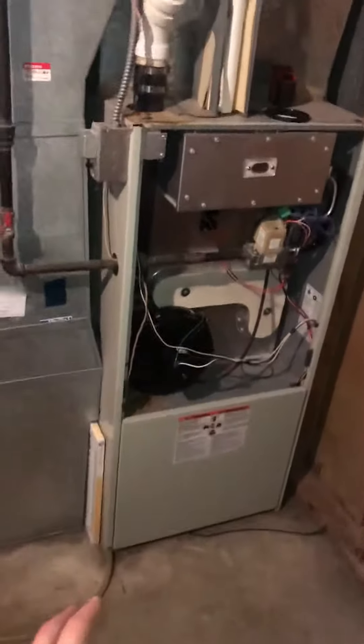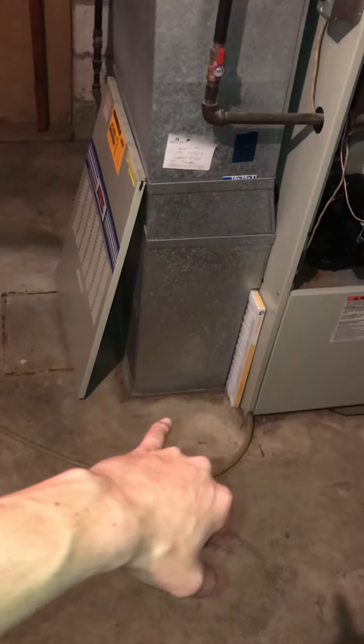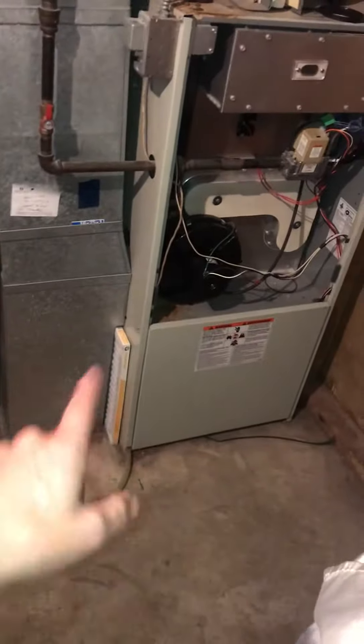I'm thinking we're going to get you guys a base can so it works pretty well. You've got the entire plenum to work up to — that's got plenty of space. We may even shorten the plenum to make it work. I'll make sure you guys have everything you need: the gas line, the electric, everything right there. The filter's too big — it's a 16 by 25 by 1. There's a 23 by 11 cold air return at the midsection. The base can and the filter rack we're putting in should make it easier to switch everything over.